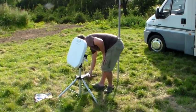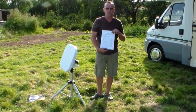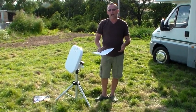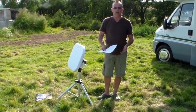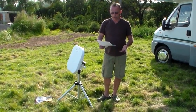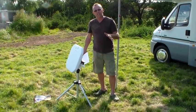We then get the elevation for the local area that you're at. You can do that with the elevation chart supplied in the kit, or alternatively you can use your smartphone, which will give you the elevation setting for the area you're in. Or if you can pick up local WiFi, you can use dishpointed.co.uk — put in the satellite, put in the postal code, and it will give you your elevation. Today we're in Warrington in Cheshire and looking at our chart, the elevation is set at 24 degrees.